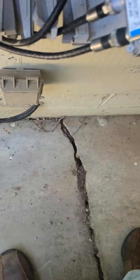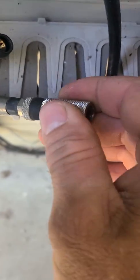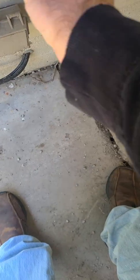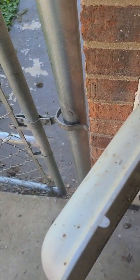So that would be my line. That's the wire for in there in the living room. None of the rest of the lines make a noise when we touch it to the inside of them — like that one doesn't, that one doesn't. But then when you touch it to this one, it makes your noise. That big piece I put on in the living room is sending voltage through to this little thing here, which is actually a speaker, and it makes a little noise — and that's how you know which wire is what.